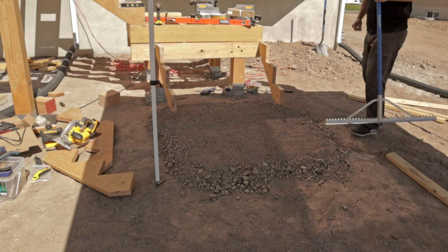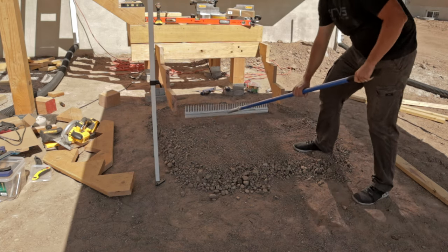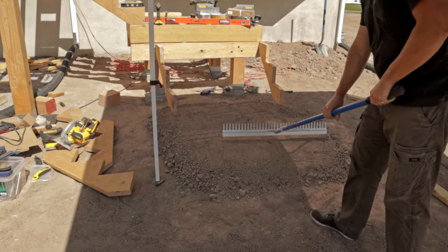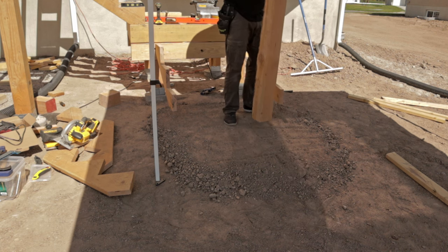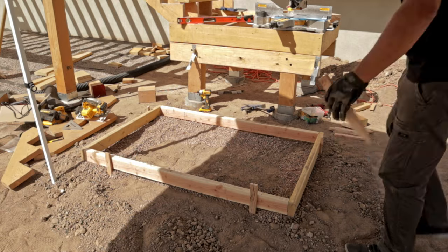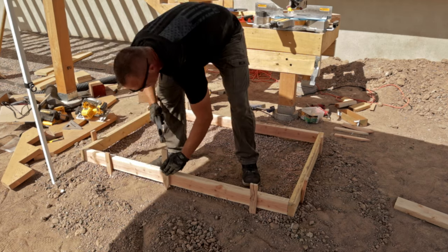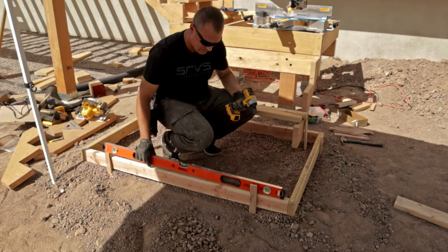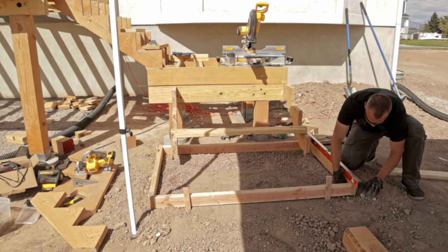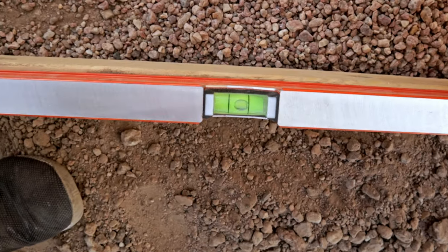On the concrete landing I am leveling and raising the pad a couple of inches from the surrounding area. When we complete the backyard we have a few inches of topsoil to add plus a couple inches of grass. I don't have a tamper to compress the ground, but this leftover six-by-six should do just fine. Keep in mind you need to adjust your stringer measurements — earlier my total rise was 68 inches, but with this concrete pad it ends up being only 64 inches. I build a box and stake it in, making sure it is level from side to side.